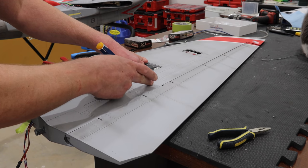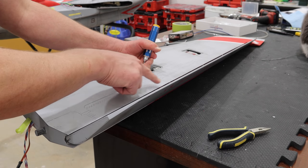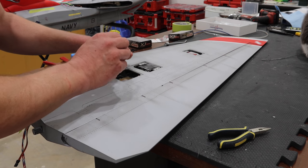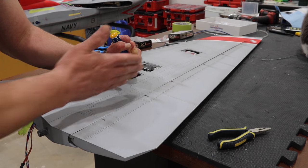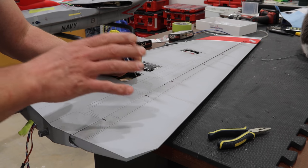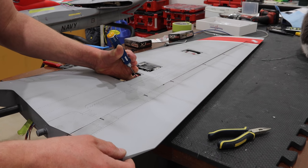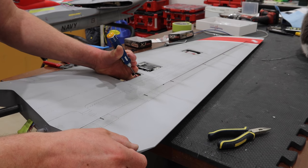Let's take that shaft and push it all the way towards the surface. Now we get more travel. That arm is maxing itself out — still no play at full flaps. But if we go to zero, there is zero play with that shaft pushed all the way towards the flap. So if you're building one of these planes and set this up with an external linkage, you may have been able to get this working without that. With the shaft pushed all the way in, it's a nice tight setup — just maybe a millimeter or two of play that the surface has, which is totally acceptable.